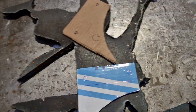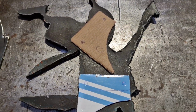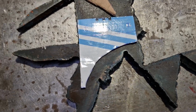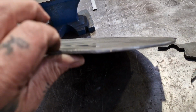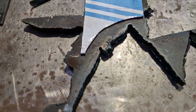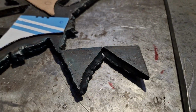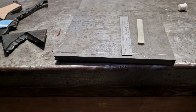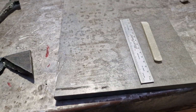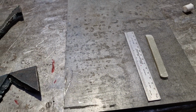So we've got 2 CADs there, cardboard aided design templates. And we're looking at, we've got 6mm plate, on paperweight, which I think is too thin. It's what I've made the rest of the gussets out of. But we've got a wee bit of 8mm plate. And then a big jump up to 12mm, which I think's way OTT, you know.